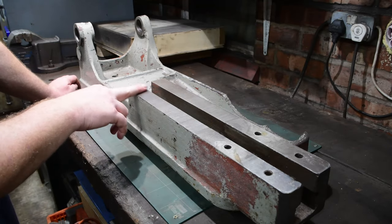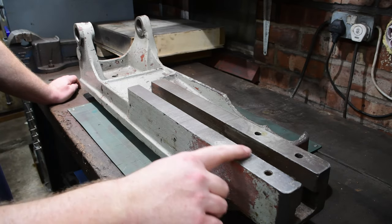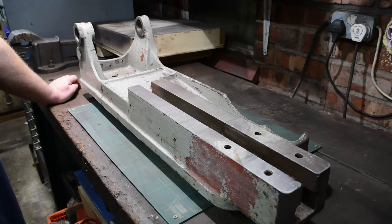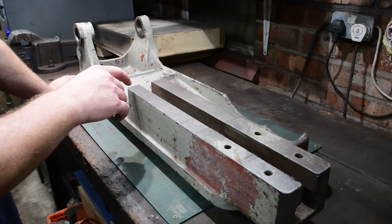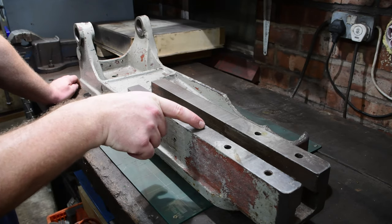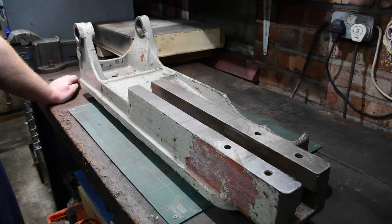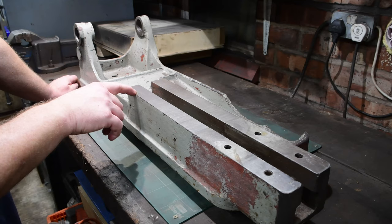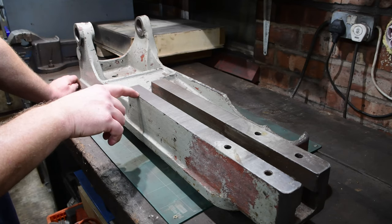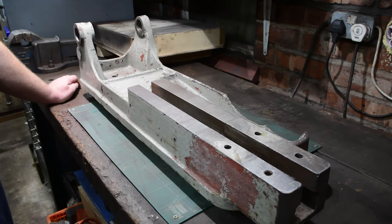The finish at parts where it's never been touched is still pretty good. My plan is to deck the top - just drop it down so the lowest part here is now flush with the rest. I'll probably have to re-stamp the serial number here because that may get lost. However, there are enough points for me to get it level on the mill.